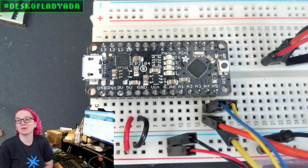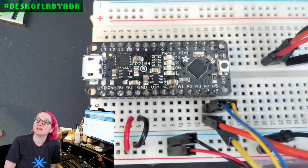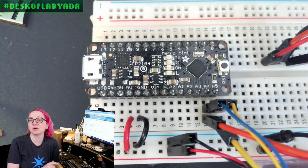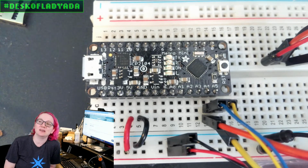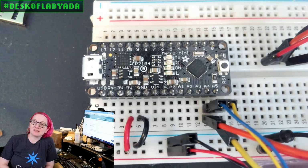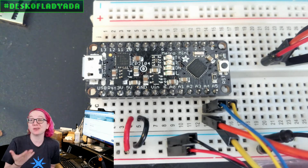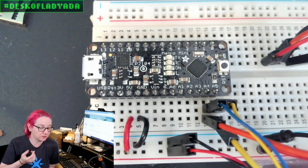So good news, I love this board, and we have quite a few in stock. We did get Atmega328s and CP2104s, and we were able to keep these in stock. But the CP2104, as we've mentioned many times on this show, is slowly being discontinued and replaced with the CP2102N, which requires a resistor divider. So I've been slowly going through all of our designs so you can basically use the CP2104 or 2102N or the CH9102, that WCH USB to serial chip, although I still like the CP series the most.